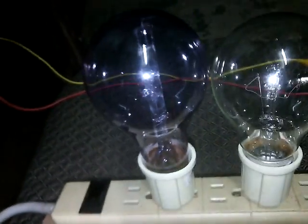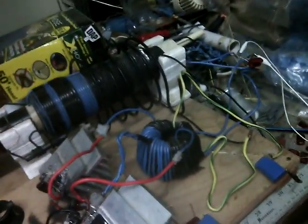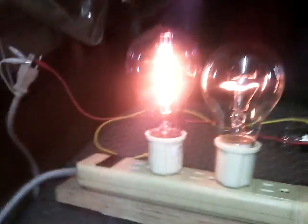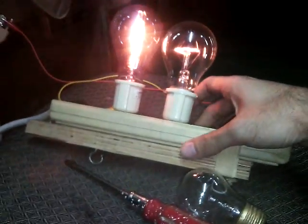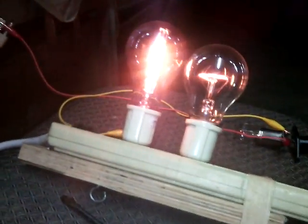Well, let's try it out. No pressure, only push-pull. We have here a halogen 60-watt, incandescent 60-watt, and two microwave light bulbs, 25-watt each. Powering the power supply and mains. We have the high-pitch frequency coming from the yoke. Now we'll be turning on these two. I managed to put like 10 of these 60-watt bulbs and they're like the same brightness all over. It's because of the amps but no voltage. Halogens tend to be brighter because of the thicker filament.